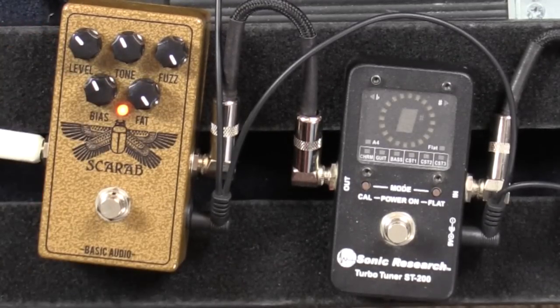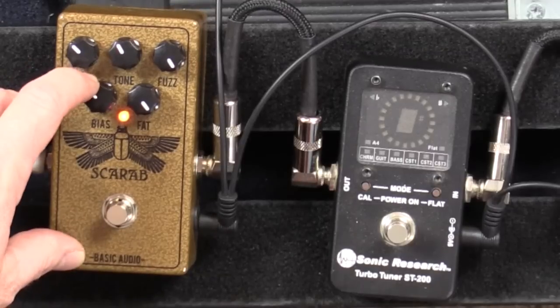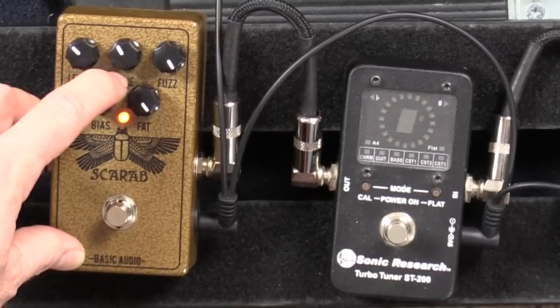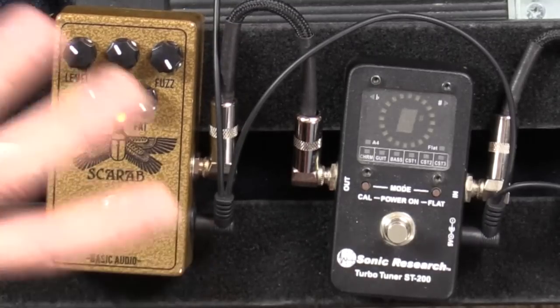When you're breadboarding transistor-type circuits, I do a lot of it by ear first, and then I measure the voltage, rather than saying, oh, it's supposed to be at 5 volts, so let's put it at 5 volts. I'll actually put it on a pot, and I'll just listen to where the cutoff is. So I'm like, okay, that's the range, and then I know what range to play with when dialing it in. You know what I mean? So, cool. Little tidbit of DIY information for you.